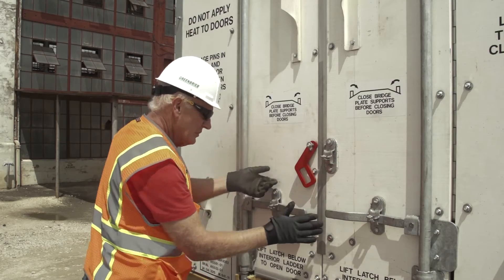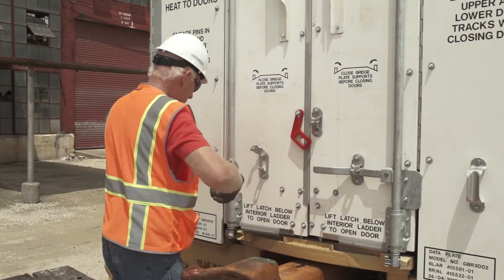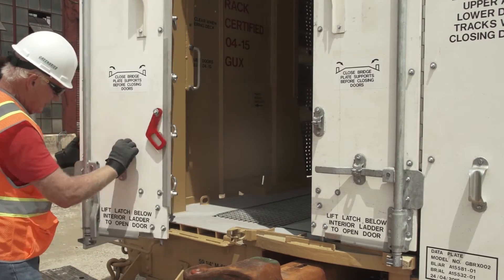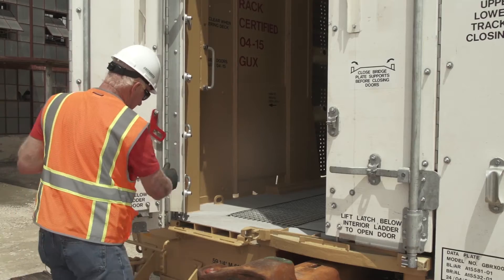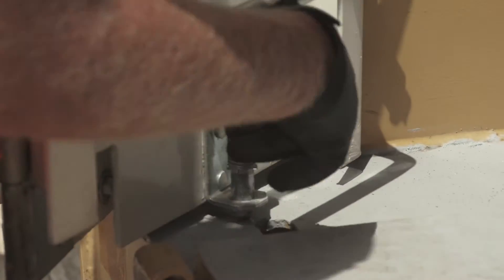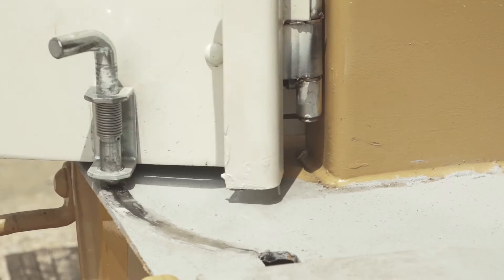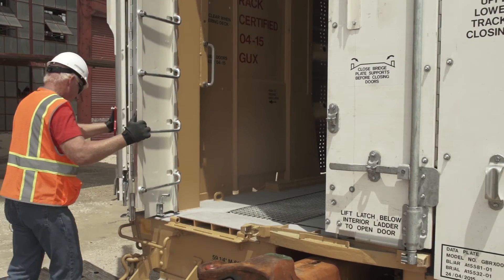Use the handle to rotate the lock rod. The second and third panels can now swing freely. Open the two panels and then push them together so that the spring latch engages. Push the latched panels toward the side of the car so that you can reach in and disengage the lock pin under the ladder on panel one, guiding the door into the pocket of the corner post.